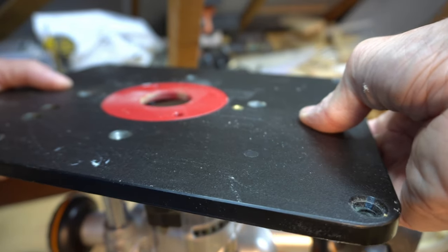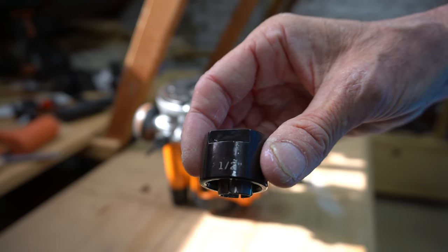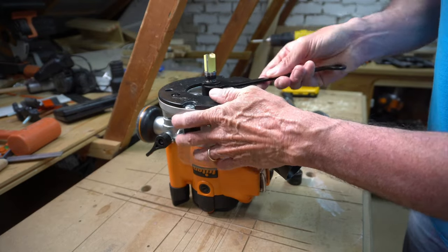Like most things on the smaller router, the winding stick is much shorter. So let's make our first cut with this router. With a half inch collet and a copying bit we can trace some holes from an old workbench top to a new workbench top.